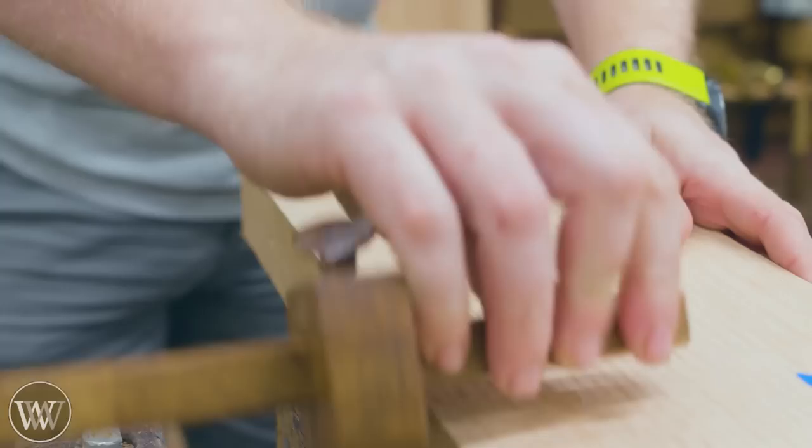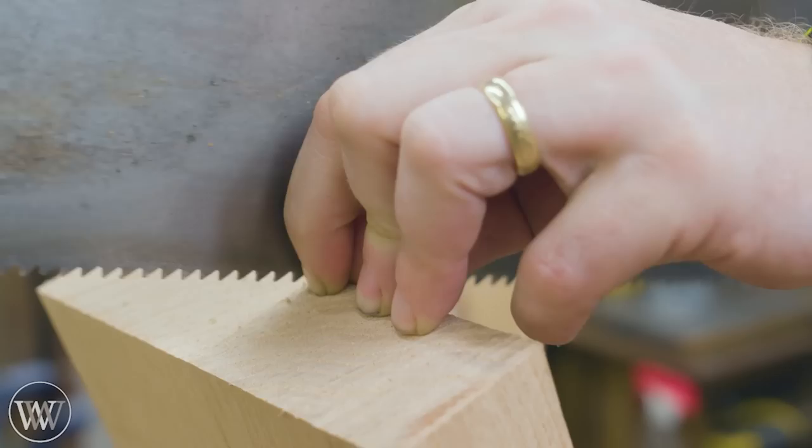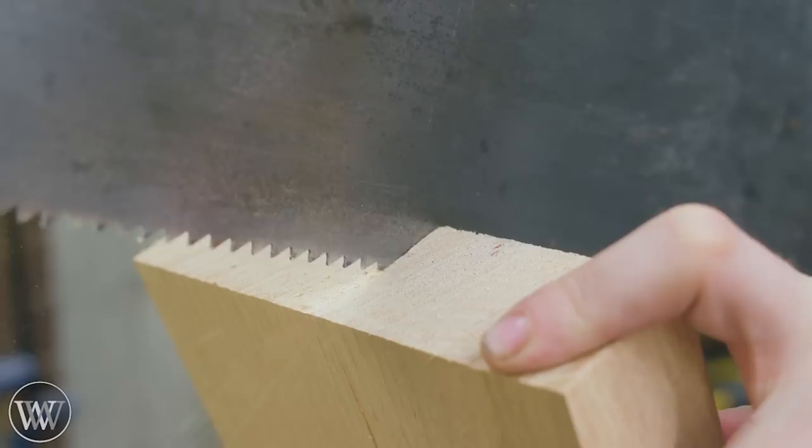For the four-quarter finished stock it goes through really quickly, but for this leg stock it's serious stuff - it's eight-quarter, milled down to slightly under seven-quarters. It's beefy oak. For the legs we want them to be three inches by three inches, so that means we need to laminate two of these together, which means we need to rip down through this almost two-inch-thick board.